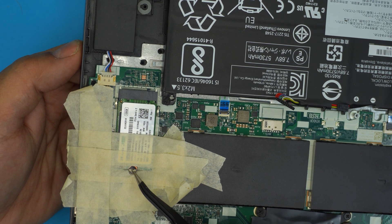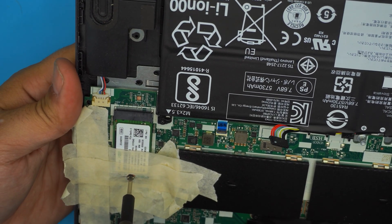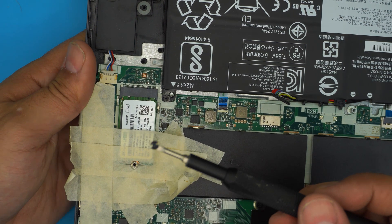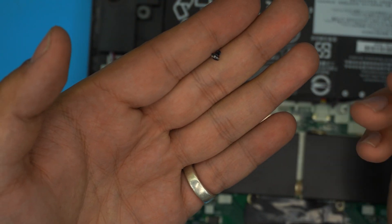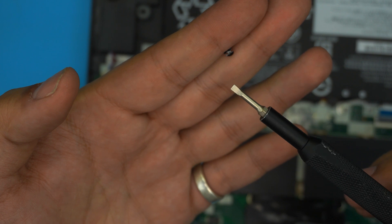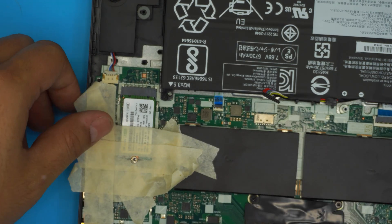Now that there's a nice deep flat slot, we're going to use a thick flat screwdriver, place it right there, press it firmly down, slowly and gently rotate — and we can see the screw coming out. Now we can replace the screw with a new one. Obviously, don't overtighten the new screw. Flat screwdrivers are better than Phillips when you have a stuck screw. I'll leave a link in the description for replacement screws.